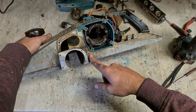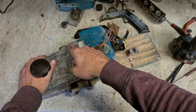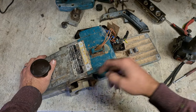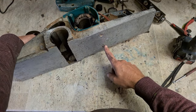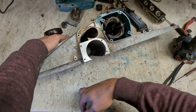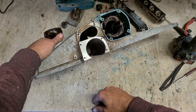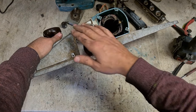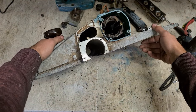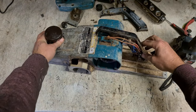If you want to go any further with us, if you have to take the motor or anything off, if you take the nameplate off, four wee pins, then there's three bolts underneath. Two bolts under here, that whole motor assembly just pulls away. And the top plate then, for the handle, and the top base, that can come away as well. The rest of it then is just one piece of aluminium. Nice machine. Better tidy it up here now.